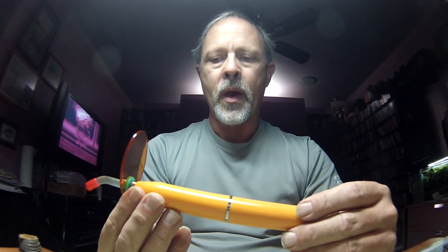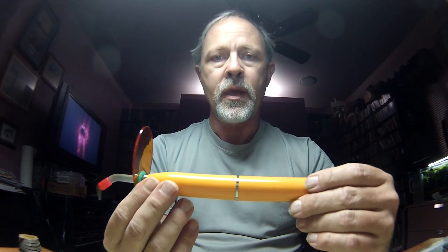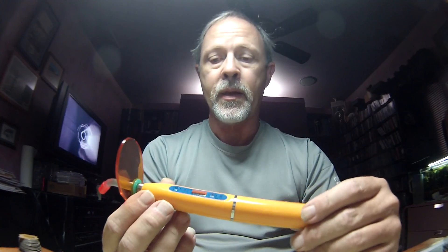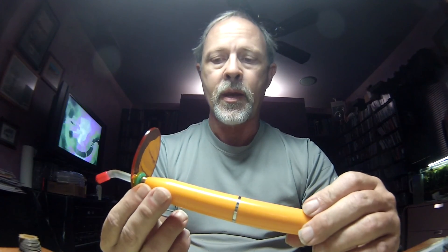The problem was the frequency of the UV light on this originally was not right — it would not set the UV cure resins we use for fly tying, which require a slightly higher frequency. So I ordered the correct LED in the correct frequency, took this thing apart, put the new UV LED bulb in, and it works like a champ.